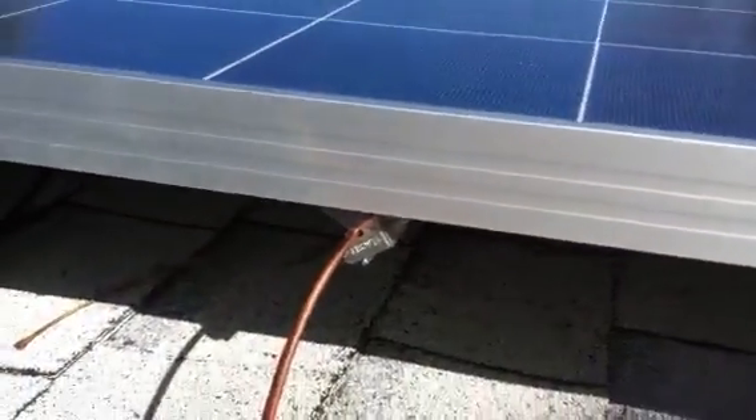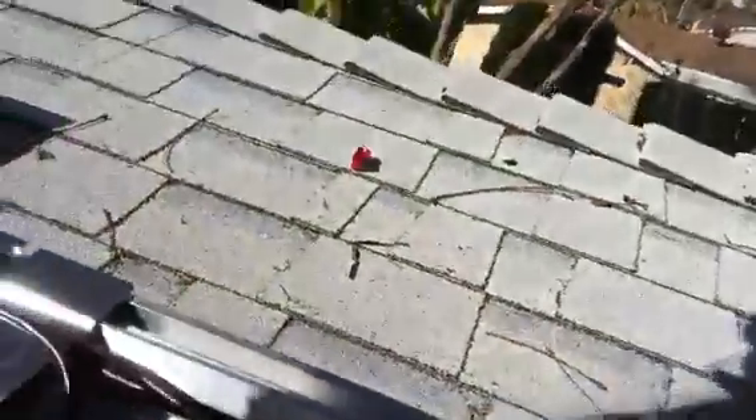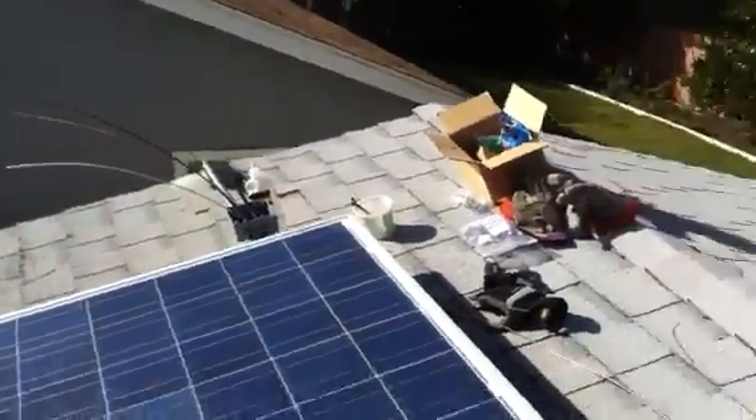This is uninterrupted ground all the way back to the grounding rod through the conduit. A little bit of extra work to do that, but this is what in Fullerton is required by the inspectors, and many other localities imagine similar, in order to make sure you have everything properly grounded.